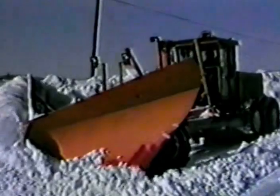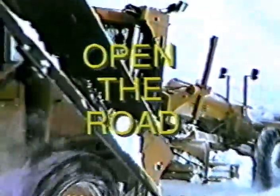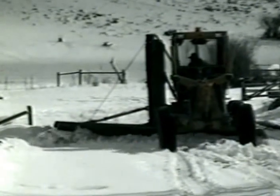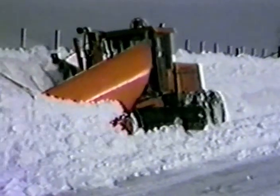There are primarily three concerns when removing snow from the road. The first is making the road passable for passenger and commercial vehicles. The second is to help keep the road free of drifts that might accumulate in the future by not leaving windrows for new snow to drift against. The third consideration is to leave room for future snow to be removed from the road. It is also important not to damage the road surface, fire hydrants, culvert covers, or guardrails.